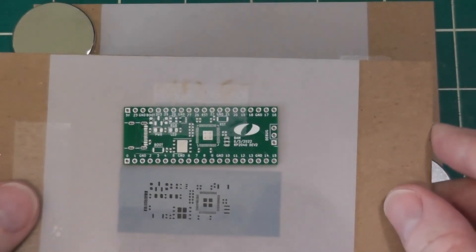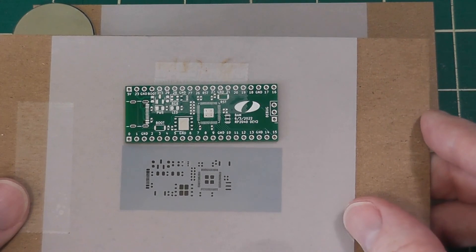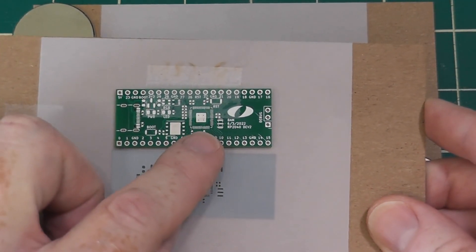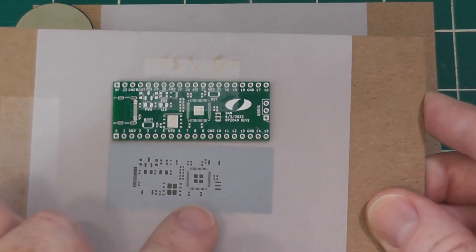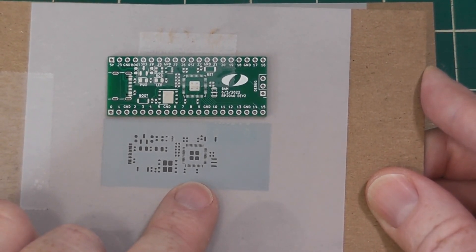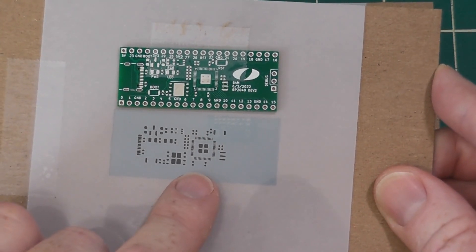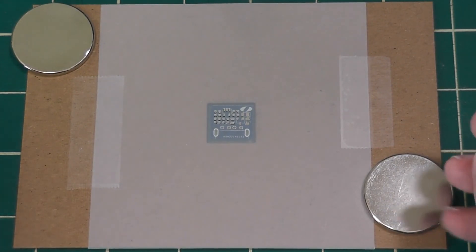As a teaser, I've also had really good luck with this same technique for cutting stencils for much harder packages than 0603s, 0805s, and SOT23. This is a microcontroller dev board that involves a USB Type-C connector and an RP2040, which has a 400 micron — 0.4 millimeter — pad pitch. You can see the stencil looks very promising. The windows for the pads around the microcontroller and the USB-C connector, which have a 0.5 millimeter pitch, are distinct and there's mylar between them. I'm looking forward to giving that a try. That's it for this — thanks for watching.